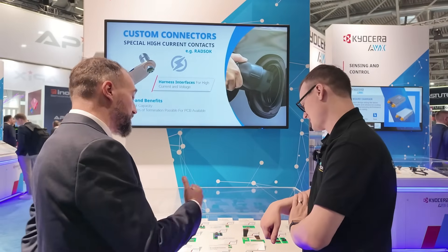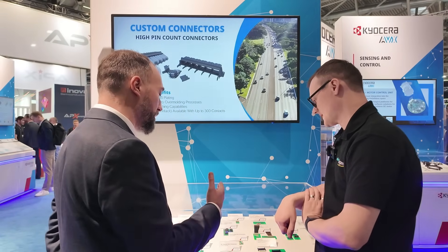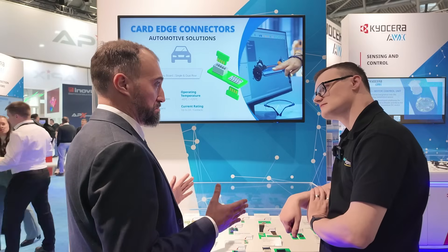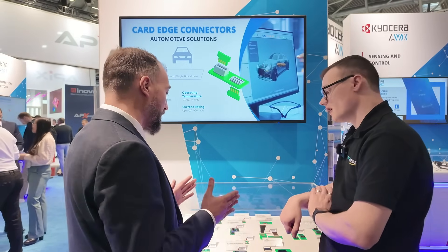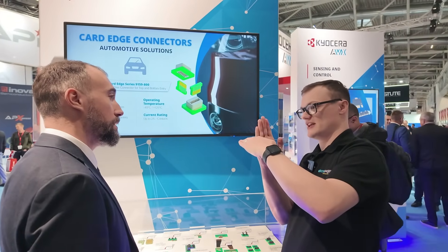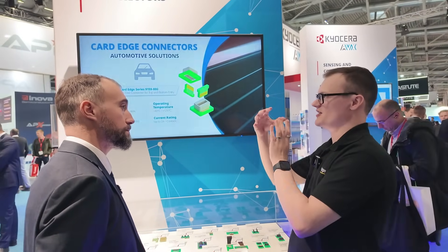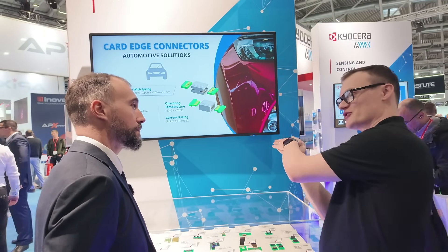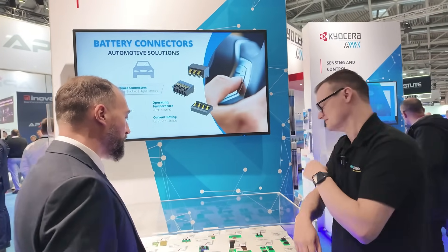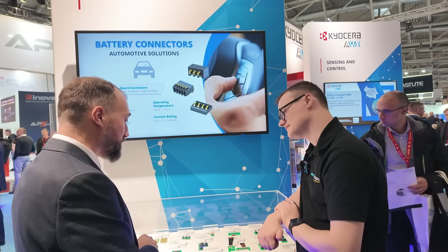There's also a technical reliability benefit. For over 20 years in the custom automotive area, customers who laid down the capacitor found that during a crash or accident the solder lead would break at too high a failure rate. If the board is oriented so the capacitor is perpendicular, you get a lot of stress acting on it; if it's laid flat, the force is in line with the capacitor so it's not going to flip over on impact.